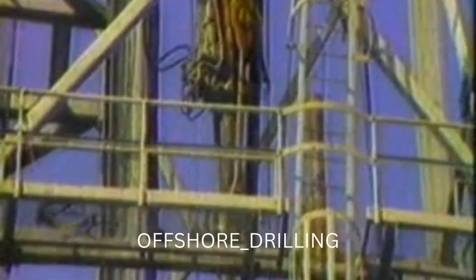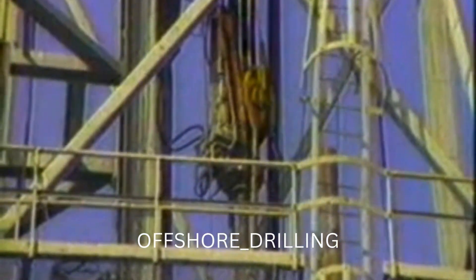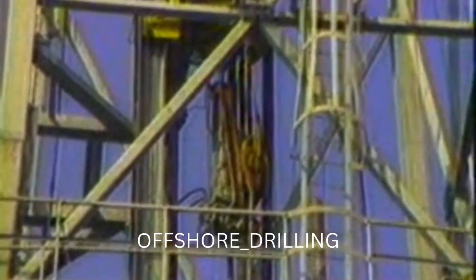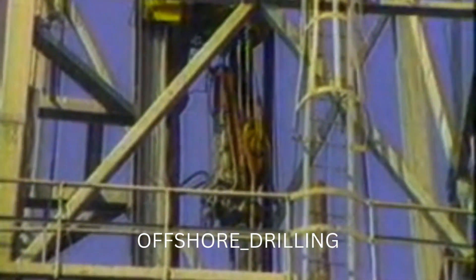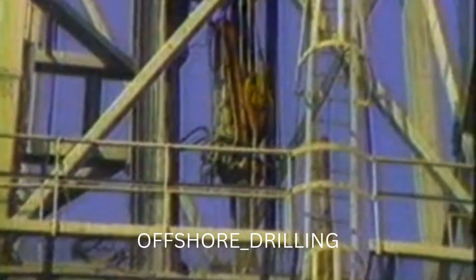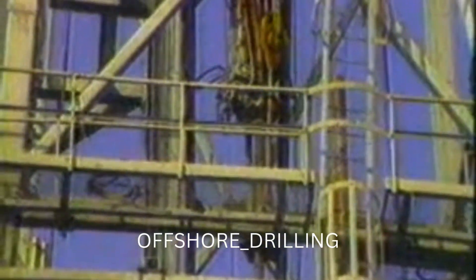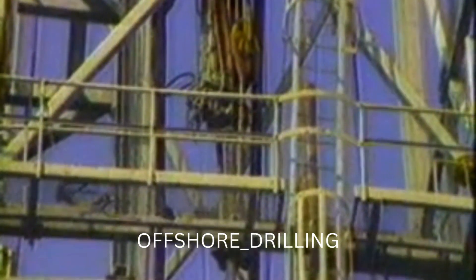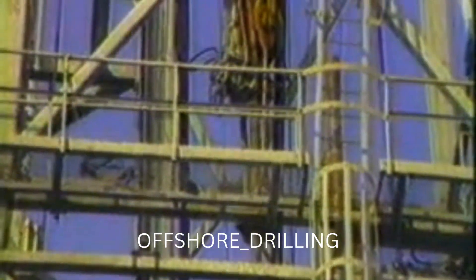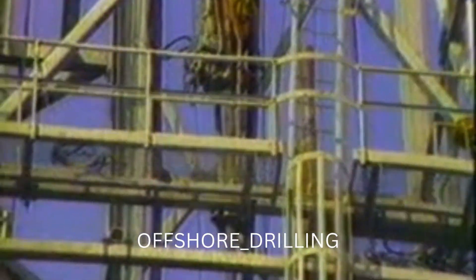The ability to have what would normally be the Kelly connection immediately available during trips is likely to prove one of the most valuable features of the power sub drilling system. Should the driller experience a kick while tripping — statistically when about half of all kicks occur — he needs only to stab the power sub back into the string by slacking off, rotating, and torquing in the normal manner. That quickly he's back on the Kelly and able to pump into the well to re-establish reservoir dominance. Since connections are made quickly, stripping back in hole stands at a time if needed requires minimal interruption in pumping.